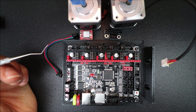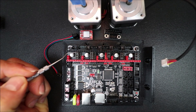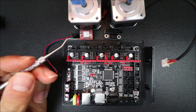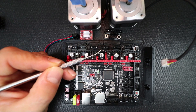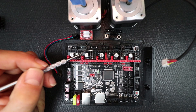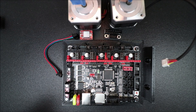I prepared a little bit of the board in advance to shorten the tutorial. Basically these jumpers when they arrive are on two pins instead of three. You only need three pins that are jumped: MS0, MS1, and MS2. All the other ones will be the same but for the Z-axis I pre-prepared this.